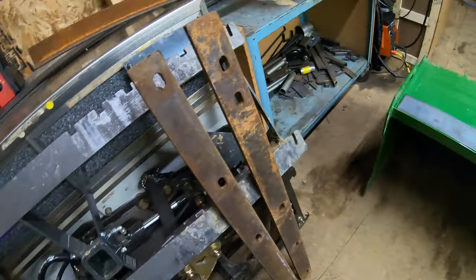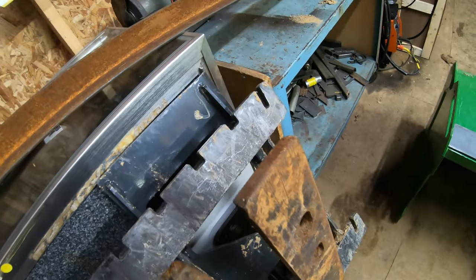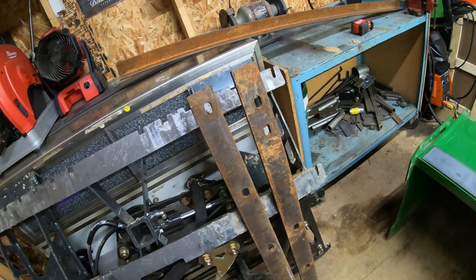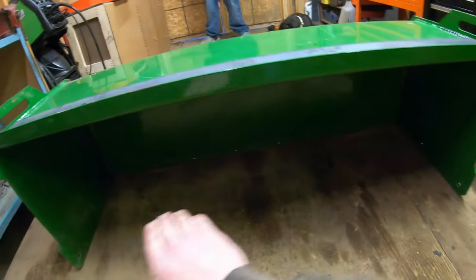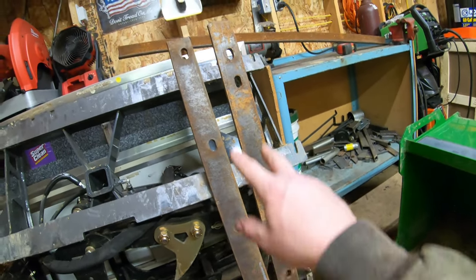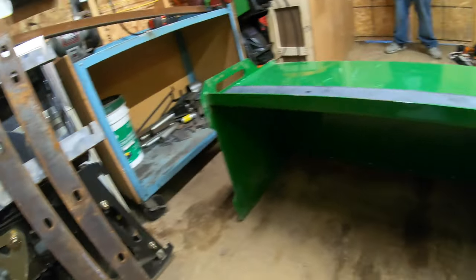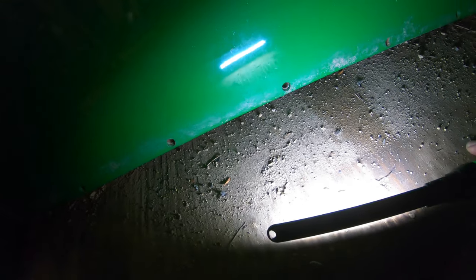As far as the bottom cutting edge, I've got these two pieces of hardened steel right here. These are half inch thick by three inch. These actually came off of my buddy's plow — he gave me these for this project. I'm going to have to cut each one of them down and use one for each side, meeting in the center. The nice thing is on this push box they've got pre-drilled holes and they're already pre-threaded as well, so I can thread in a regular half inch standard bolt right into them without worrying about nuts and washers on the backside.